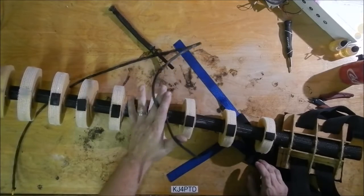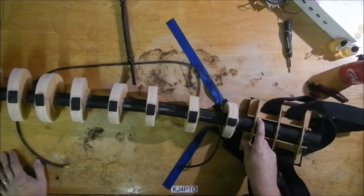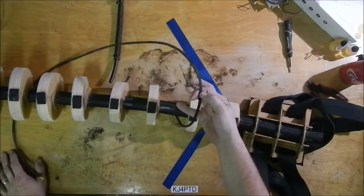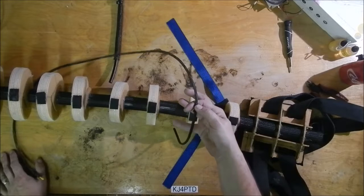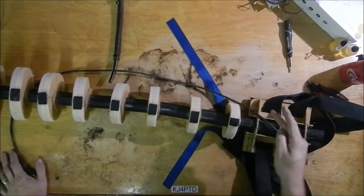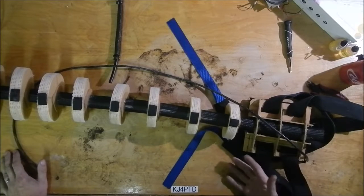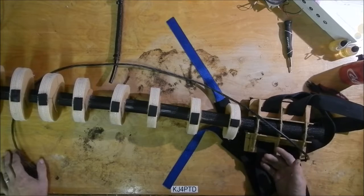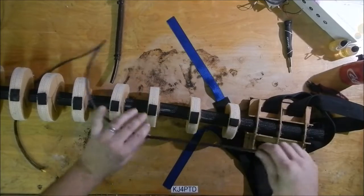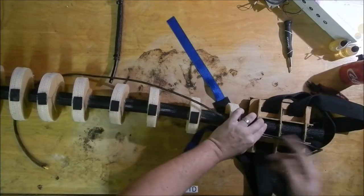Having such a short line and not being able to have the air pressure relief valve right at where I need to dump the pressure, so this is basically the end of the cylinder, the end of the pressure vessel that needs to vent, and it will be right here. Ideally, I should have a relief valve, 3 relief valves right here. I can push pressure in quickly. Letting it back out is what will go slow. So I'm not going to have the valves here. They're going to be at the end of what could be up to 3 feet of airline running up into my backpack.